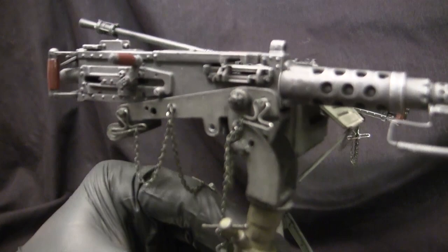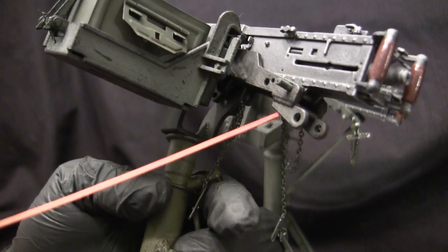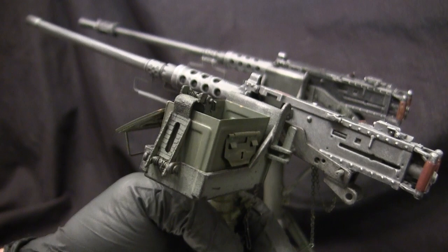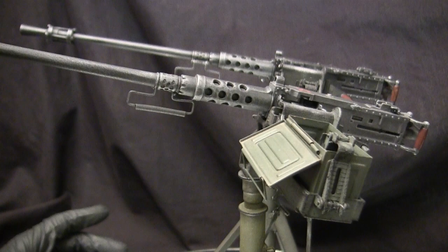One other thing I need to mention is that while on the other unit, the can rail holder mechanism is stamped and bolted on, on this system here, it's actually welded permanently in place and it's not changeable. On the back, the travel lock system is again a steel bracket that has been welded to shape. Compared between the two, this unit here is much easier to put together and is arguably more efficient, which is why if you look at modern M2HB system holders, they tend to follow this type of format with the use of stampings.